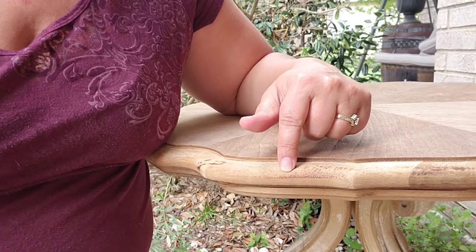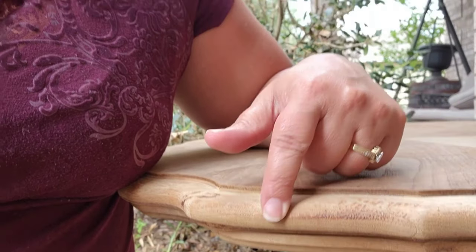I'm actually really satisfied with the way it came out this time now that it's all dry. I found that the harder you scrub, you actually can get a lot of that off. There are still some really fine parts that still have stain on them, but there's not very many and this could probably be hand sanded and it'll come right off. So I'm going to call this done after two coats of oven cleaner. I do feel the second coat was 100% needed. I don't feel like even if I scrubbed harder the first time it all would have came off — there was just so much left over. For two applications it came out very clean the second time. Just a few minor issues, but I also have a few minor issues on the Citrus Strip one, though that one only took one time.